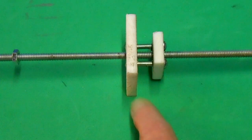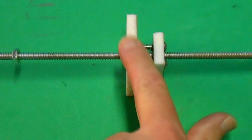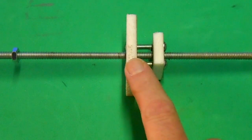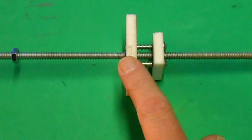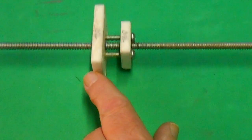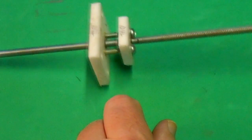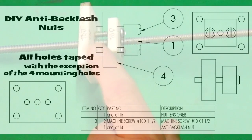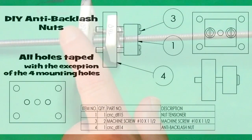Here's an actual sample of the anti-backlash nuts that I made for my homemade CNC machine. This material is actually a piece of a cutting board — I went to Walmart and bought one because I didn't have any Delrin on hand. That's typically what you use: a plastic that is self-lubricating, and a cutting board has those characteristics. These are pretty easy to make. You just cut it into squares on your table saw; it cuts pretty easy.